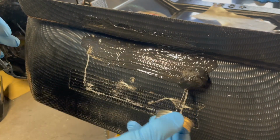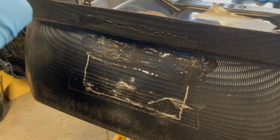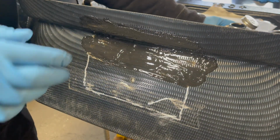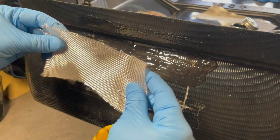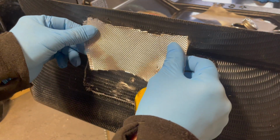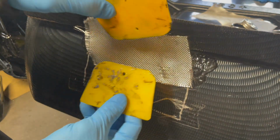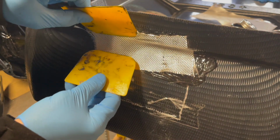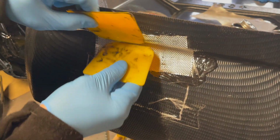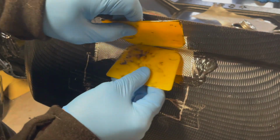We're going to do this twice. On our first day, we're putting the solvent cement down, then fabric, and then solvent cement. And then the next day, tomorrow, we'll come back, clean it up, and sharpen up the edges. So I'm establishing the top, and here I'm using a paddle. The top one is to cleat it down so that when I push it up into the corner, it doesn't pull it down. I'm using the soft radius edges.